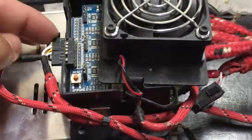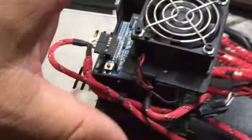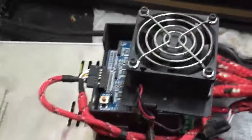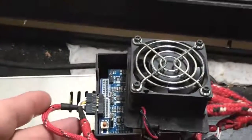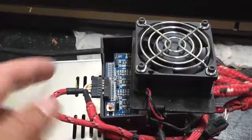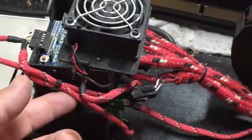I was also asked how I keep my pins in — they're held in right there. I've got my whole enclosure flipped around: stepper motors coming out the front, and the limit switches and spindle control coming out the back. The smaller wire is easier to loop around so it won't come out, and I'm holding the loop in with a couple of zip ties.